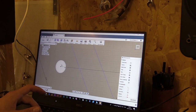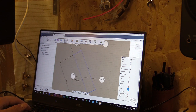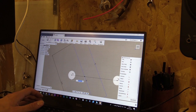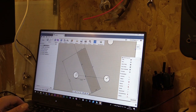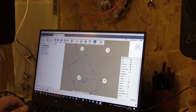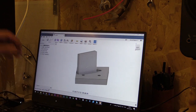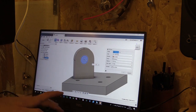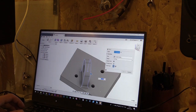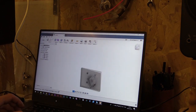I then created a new sketch on top of the extruded component and made an angled rectangle where I wanted the mounting section to go. I added constraints to make these two lines parallel and those two lines parallel, worked out the offset so it's perfectly centred. I extruded that with a joining operation, and on one of its faces created a new sketch with the shape and opening for the attachment bolt, extruded that with a cutting operation to leave the desired shape, then used the fillet tool to round over all the edges and make the jig more ergonomic.